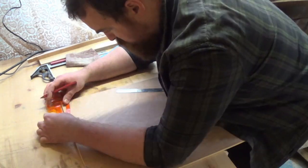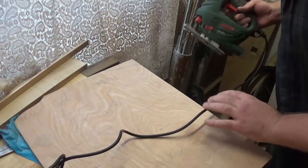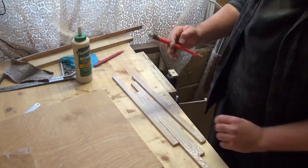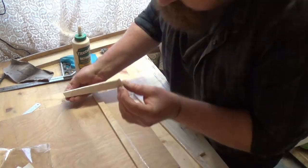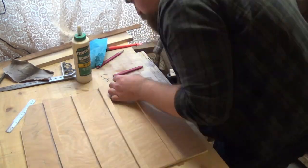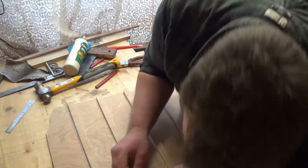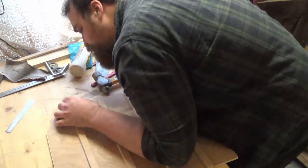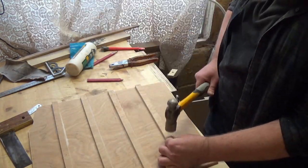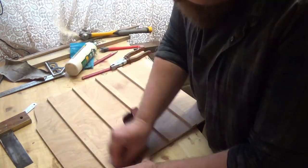Using just some French curves to get the shaping at the top, cutting that out with my jigsaw. I'm using Titebond 3 to glue all these raised areas on — that gives me a good solid bond. I'm also using some panel pins to set those in position while it dries, which allows me to get on with the painting. Then I fill in all of those panel pin holes with some wood filler, let that dry, before giving it a good sand.